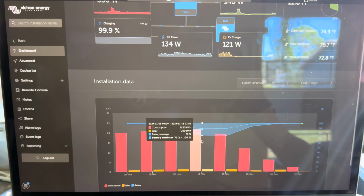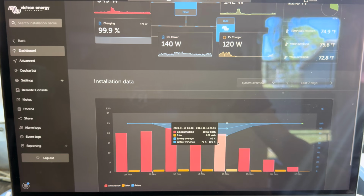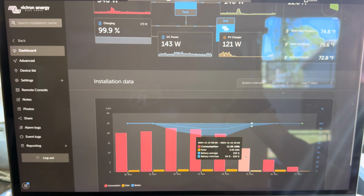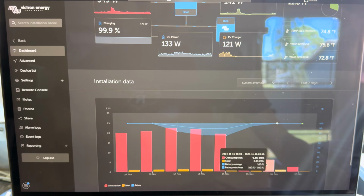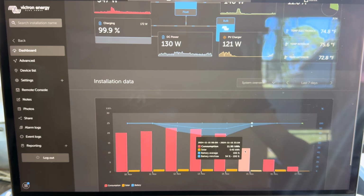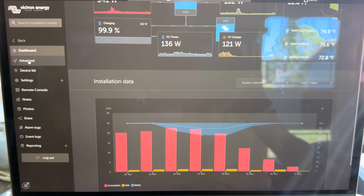So if I'm pulling 6 kilowatt hours over a 24-hour period, that means that realistically these 20 to 22 for both air conditioners, just the air conditioners themselves to be running, is more around the, you know, 14, 15 kilowatt hours in total. And then again, here where it pulled 11.95, let's just call it 12 kilowatt hours, and this pulled just over 6. So that means less than 6 kilowatt hours it took to run that Turbro unit over a 24-hour period, again, while the temperatures were in the mid-80s.